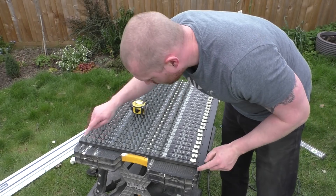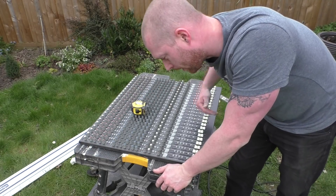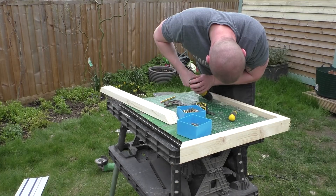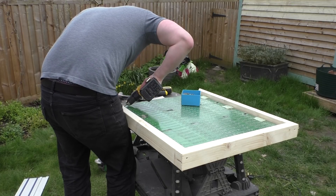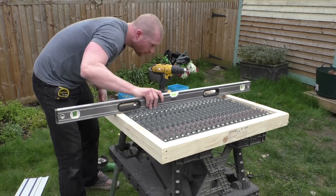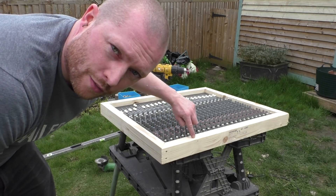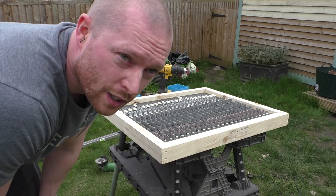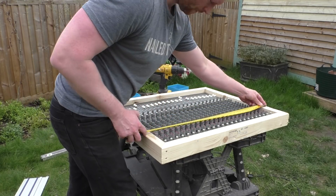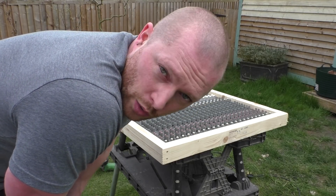What I'm going to do is measure this side edge, get a bit of timber, cut two 45s on it and then start working my way around to build a 3x2 frame. I'm going to measure from about halfway around the frame to each side and get an idea of what size piece of glass I need — 60 centimetres by 72, so 600 by 720. I'm going to order that. Toughened.